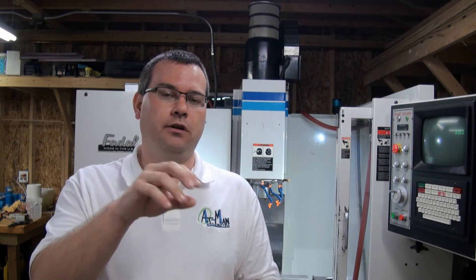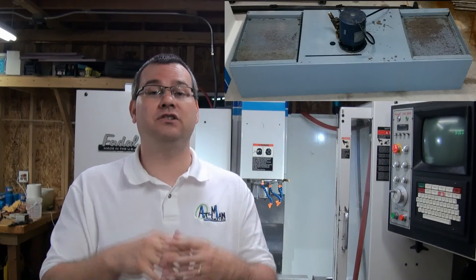Finally, we have to consider coolant use. With personal CNC machines, you're typically not going to use flood coolant — you'll probably use a mister or fogger, if you use any coolant at all. Some do use flood coolant, but the sumps are only a couple of gallons. On a vertical machining center, even the smallest machines are going to have a sump of 35 to 40 gallons of coolant, so you need a significantly larger volume. You need to account for the cost of the coolant and also its disposal. They use a water-soluble oil, and if it's dumped down the drain it can cause major problems with your municipality's sewer system, so proper disposal is very important.